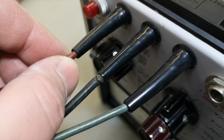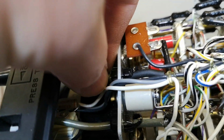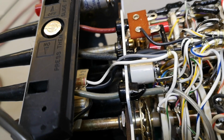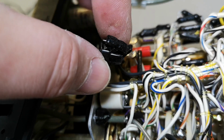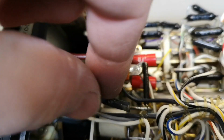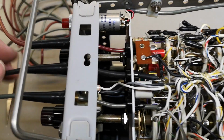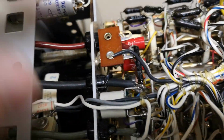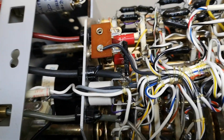But these are actually quite alright. I think I'll see if I can get this crusty cable loose somehow, and change it. Yep, that was actually quite easy. Just push this release and pull it out. So just cut the wire here so I can easily see where to mount it. This thing is really meant to be serviced and repaired. So you can change those cables just as easily, pushing out those things and just soldering it all in again. I'm really happy about that.